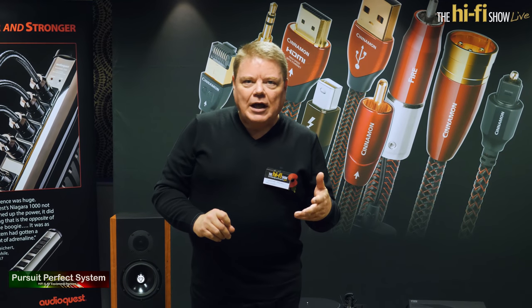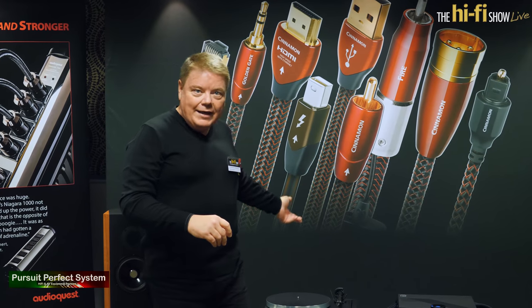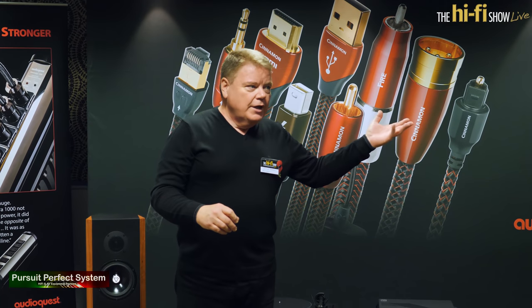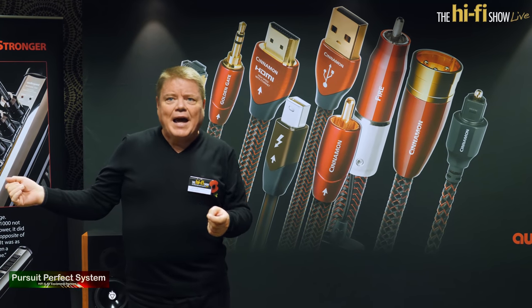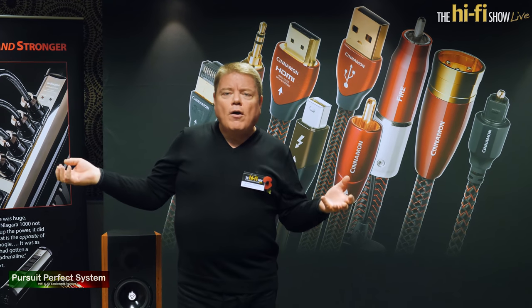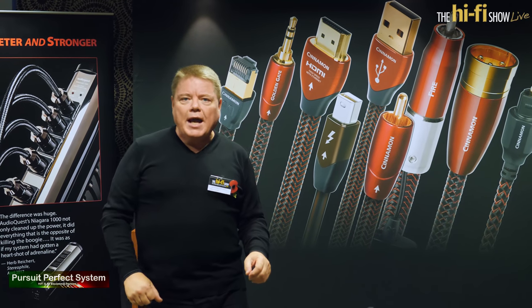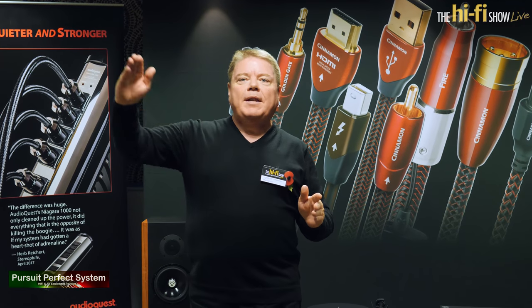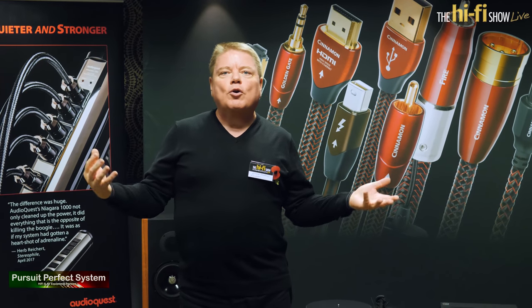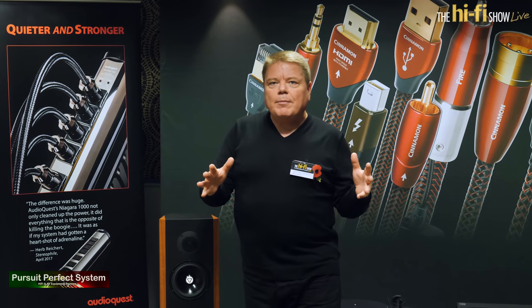If we talk about a lot of the noise that's coming from various electronics in a system, or on the AC mains, for example from different motors and things like that, but also a great deal of it, at least 10 octaves of it, is just radiated RF noise that's basically through our atmosphere and induced into the cable. And the reason that's a problem is that even though it's many, many octaves above, it's not that you're going to hear your local FM rock station coming through your system.